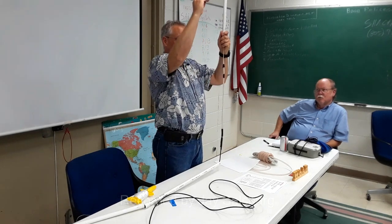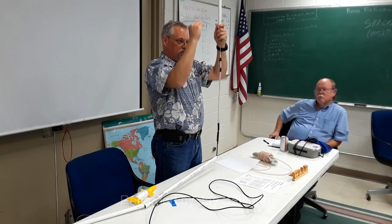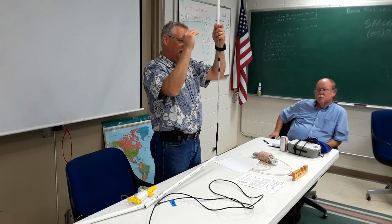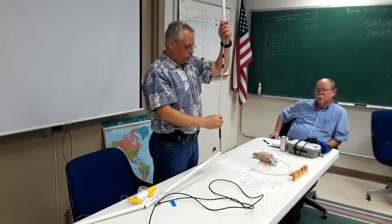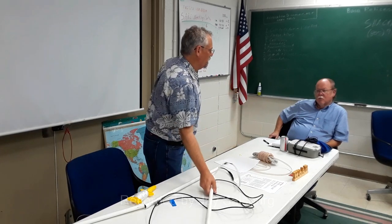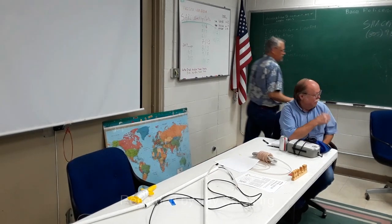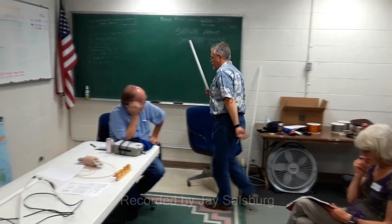And you'll watch it go down on the band. As you approach it, just tiny little nibbles will bring it right down into your band. Okay? So you trim it, put it back together, measure. I built this one for this pipe. That's half inch schedule 40.